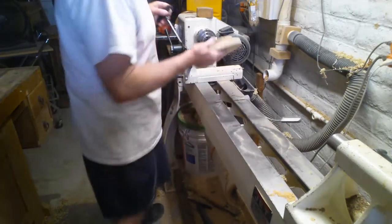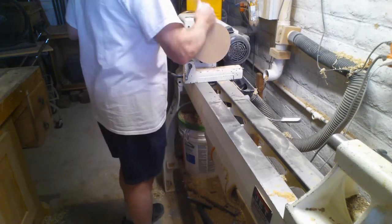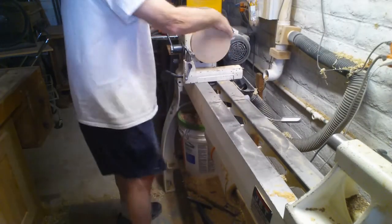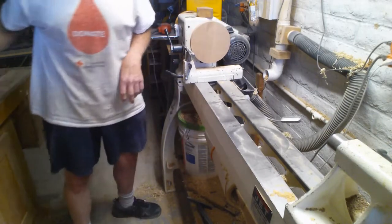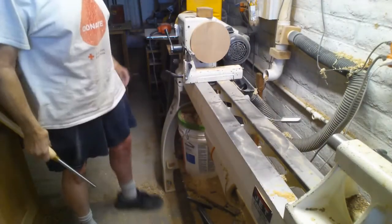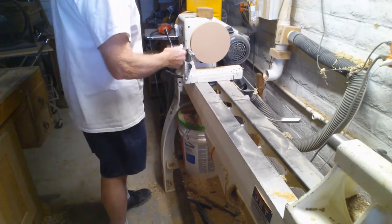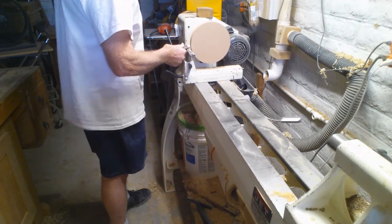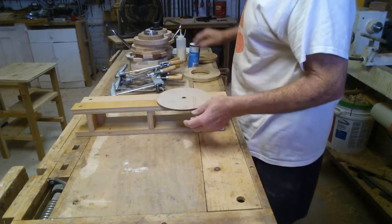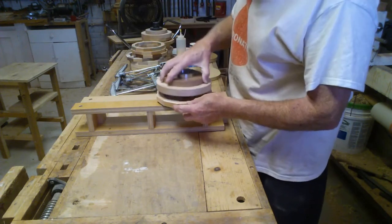It's going on the Nova. I could glue a ring on already — it's not perfectly round — but I'd like to make it lathe-round first, not just bandsaw-round. So I'm going to put my face shield on and get going — this doesn't take long because it's pretty round already. I usually go about 1,100 RPMs; I'm comfortable with it and the lathe doesn't seem to mind. I use my left and right hand when I work — I've taught myself to use both. There it is, all ready to go, looking for its first ring.